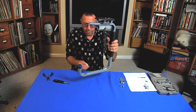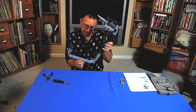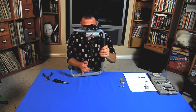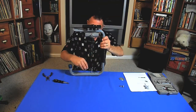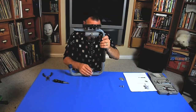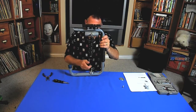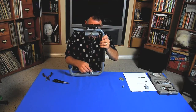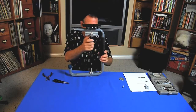Finally, we'll take our two-and-a-quarter-inch quarter-20 round head machine screw, mount that up through the bottom of the brace, and take a quarter-inch nut and spin that on to secure this screw into the brace so it protrudes through the bottom. Then I'll use about seven of the inch-and-a-quarter fender washers to act as a counterweight, plus a one-inch fender washer to secure the other fender washers. Take a wing nut and put that on to secure those fender washers — they act as a counterweight. As you add more weight up top with a heavier camera, you may need to add more washers to achieve the correct balance.